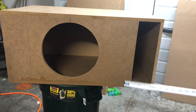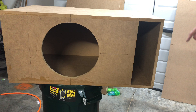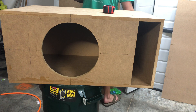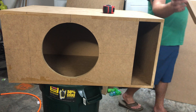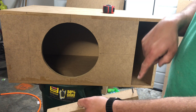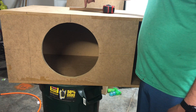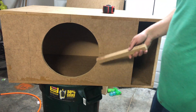There's a 15-by-15-inch hole. To cut it, you need to find the cutout diameter, divide by two, and use a wood jig — drill a hole, measure from that hole to another hole, put a screw in one hole and a drill bit in the other. Put the drill bit in the middle of the box and spin it; it will give you the perfect cutout every time.